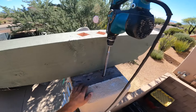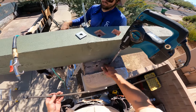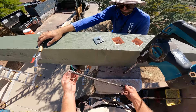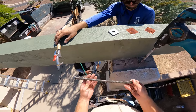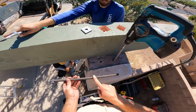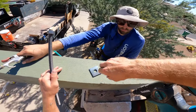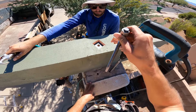One thing you've got to do is drill into your masonry surface. If it's block, you've got to make sure it's filled solid — if it's not, the epoxy is just going to fall in and go into oblivion. I'm using a 5/8-inch threaded rod bolt, so that means you need to use a size bigger for your drill bit — a 3/4-inch drill bit. We already drilled through the beam and have little pockets here for the post to sit into, so the bolt goes in through there.